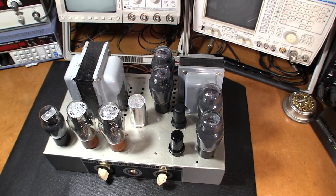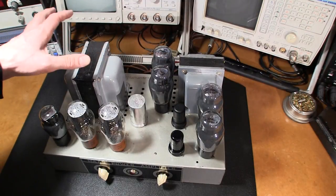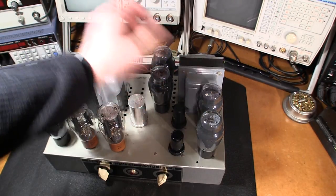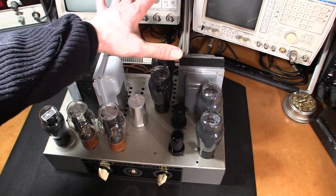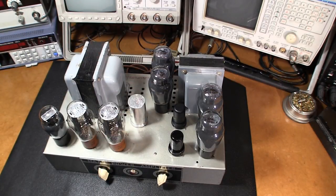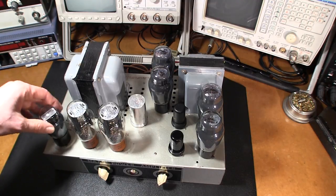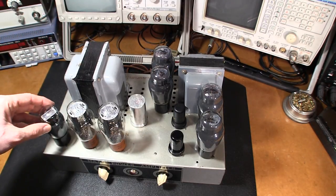You can see why the amplifier needs to be relatively large — it's announcing this to an entire town. That's why you see so many 6L6s, and it has two rectifiers. There's a lot of built-in redundancy: if one 6L6 goes flat, the thing runs off three with no problem. If one phase inverter tube dies, it still plays through one tube. If one rectifier dies, it still plays at reduced volume. The only real weak link is this particular tube used as a form of pass regulation.